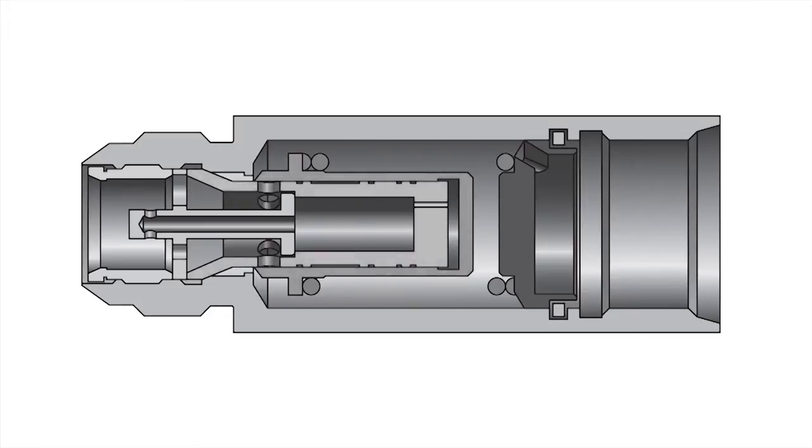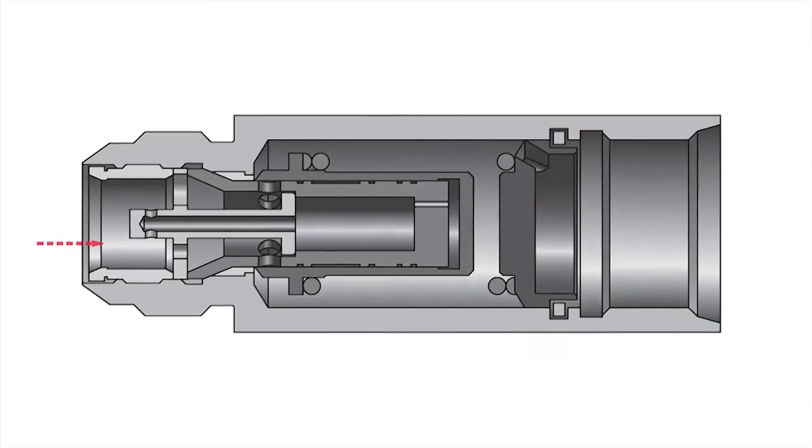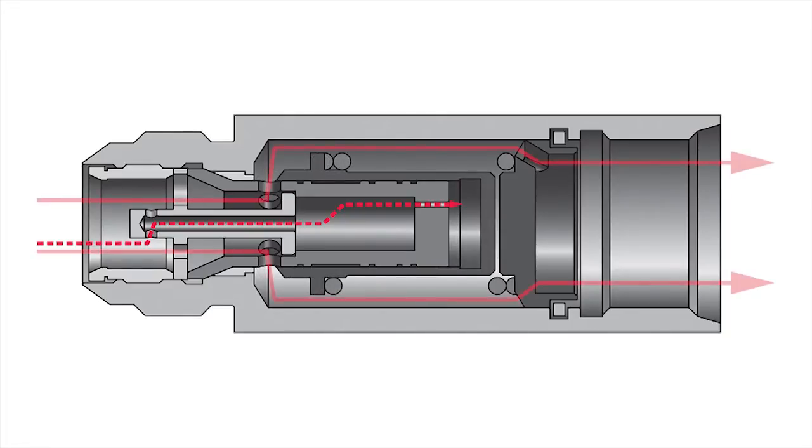Utilizing technology Jask had previously implemented in the aerospace industry, the Jask liquid fuel check valve uses an inverted spool design. Instead of a spring-loaded ball, the inverted spool uses a guided poppet. As the poppet opens, it meters fuel and holds a very specific delta pressure across the valve, so they will all open uniformly and simultaneously. The benefits of this valve configuration are increased thermal stability with can-to-can temperature splits of less than 25 degrees and uniform fuel flow delivery, resulting in better engine performance.